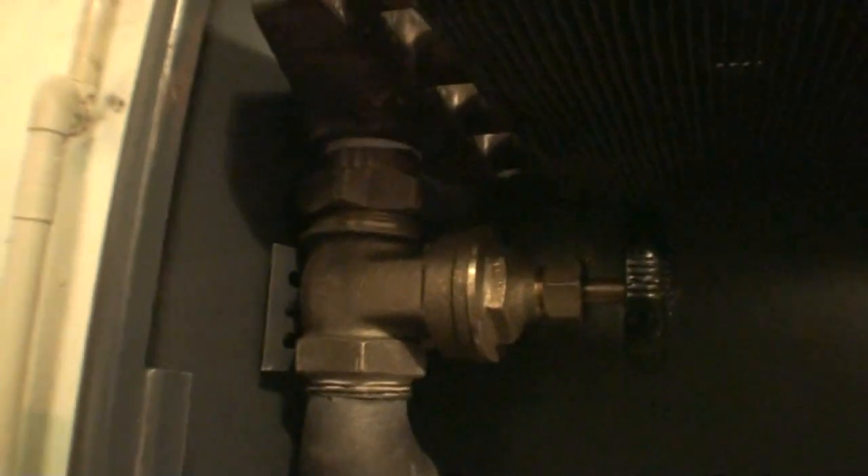This one here I found inside of an apartment building, and the super was kind enough to allow me to take it. It was garbage and I decided to use it because I could see it could still work, and it works beautifully. The only problem with this one is the connection. Normally a very common connection for this type of radiator is not a straight connection — which is why I had to offset it with two 45-degree street L's. Normally what you'd see is a nipple coming out of the radiator, an elbow, and then a piece of pipe leading into the cutoff valve, dropping back into the ground. I didn't use that option because I didn't really have a whole lot of room to do it.